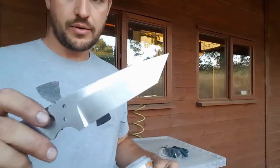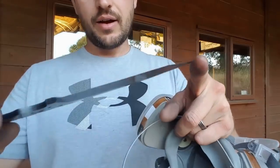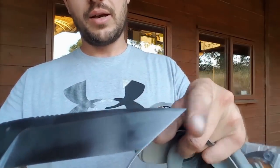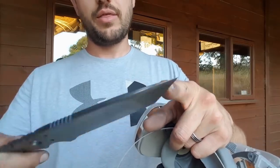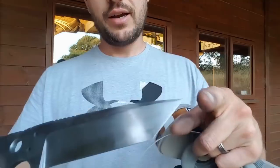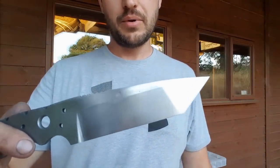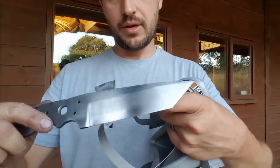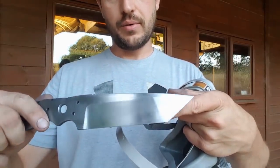But what I'm going to do now is a bit of an improvised sandblasting rig. I'm going to put a nice blasted finish all the way over here, because I'm going to put it into a ferric chloride acid etch, which should look a lot darker if we rough this up a little bit first. But the idea of the sanding was to make sure that there were no nasty scratches or anything in there first of all that were going to stand out.